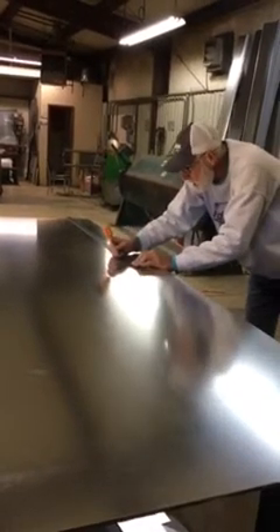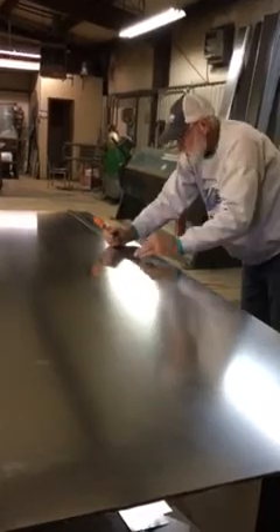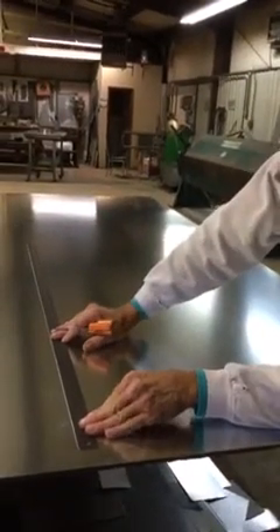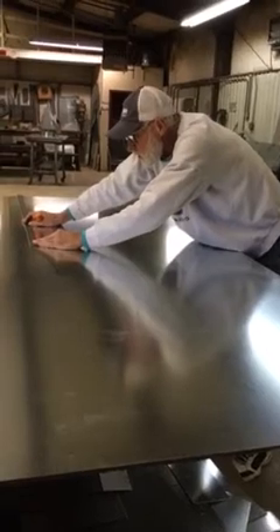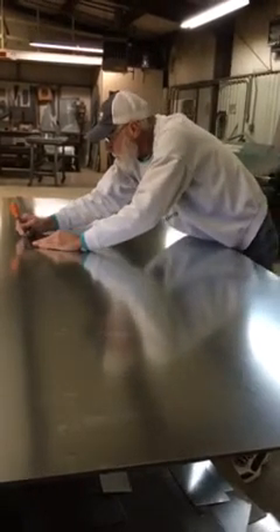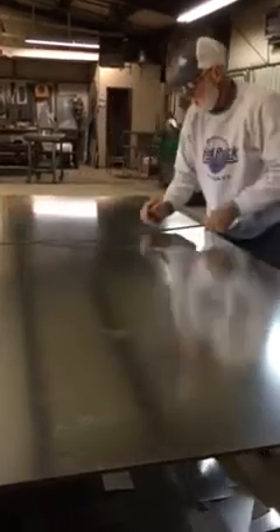This is 54 inches. My rule is 48 inches, so I'm going to go 48 plus six, then another inch and a half for the skirt on the other side. I'm going to do the same thing here: 48, add six to it which makes 54, add an inch and a half for the skirt on that side. Now I'm going to draw a line, and this is going to be the cut line.